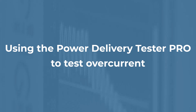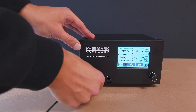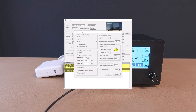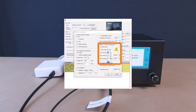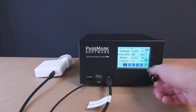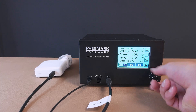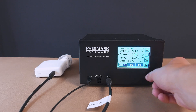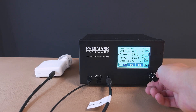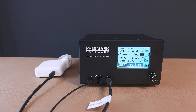The USB Power Delivery Tester Pro has a range of settings that can be configured to adjust its behaviour as a device, giving it the ability to run more advanced test cases. In this example, we will configure the tester to simulate a faulty device that ignores a charger's current limit, and then connect this to a charger to test if it has the ability to safely protect itself from a faulty device. For this test, we will use an Apple laptop charger that allows a maximum of 2.4 amps at 5 volts. As the current is increased slowly, we can see that the charger has been over-designed, as it has no problems when the maximum current is exceeded. Once the current reaches close to 4 amps, the over-current protection mechanism is triggered in the charger and the connection is reset to save the charger from any damage. This behaviour is expected in a well-designed charger, as it keeps itself safe when a faulty device is connected.